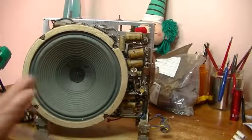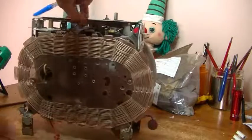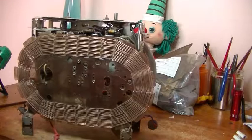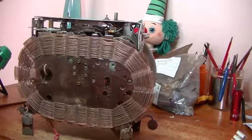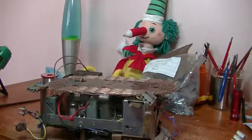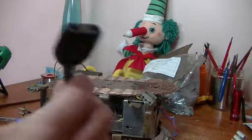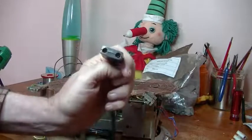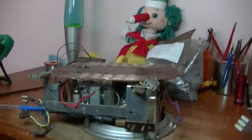This is one of the chassis I bought for parts, really because the speaker is intact and it has a very nifty basket weave aerial, which I think are just great. As far as other parts — well, there aren't really many you can take, maybe a volume knob. But the great thing is, all the valves are in there. This thing's complete and there's a good chance it's going to work. Here's the point: how do we know? These are the old power cords — there's no polarity. It can go in that way or you can turn it around and go that way. So you get a 50-50 chance of getting it right.